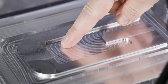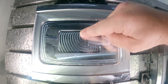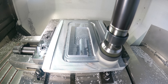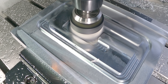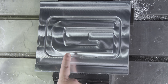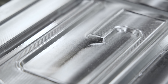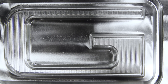If you take a look at this part, you can see that we have a beautiful finish on our floor — you can even see the reflection of my finger. With this being such a cosmetic part, we don't want to see any lines at all, so that brings us to our next secret weapon. What you see here is one of my favorite tools I've ever used — a deburr brush from Brush Research. It's got ceramic bristles, and it's basically going to act like Scotch-Brite — take all our burrs off and our machining lines, and put about a five thou edge break on all our sharp edges. The deburr brush just finished going over our part, and inside the whole G and the whole platform we have absolutely no machining lines left. That was our second trick. We can still see marks left from our brush, but we're going to cover those with our third trick later on.